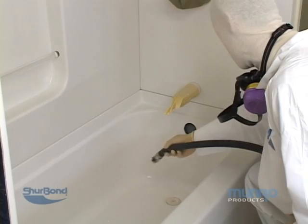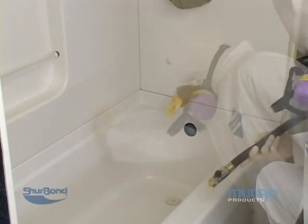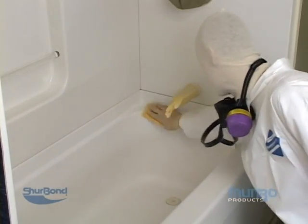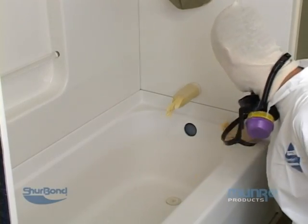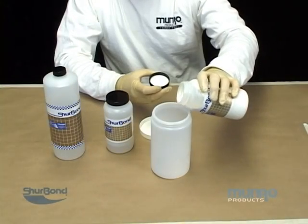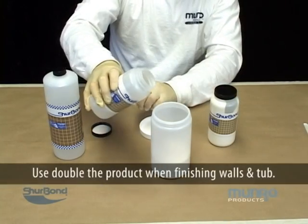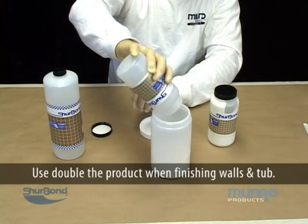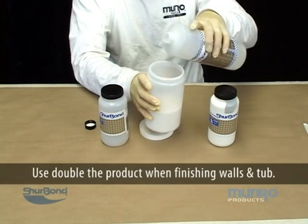You can use the compressor's air hose to speed up the dry time. Tack cloth the surface with a clean tack cloth after the primer fully dries. You will begin by mixing up 10 ounces of Sure Bond Ultra Glass 2000 top coat base with two ounces of M15000 Ultra Glass 2000 hardener, then adding two to three ounces of solvent, thinning the solution as needed.